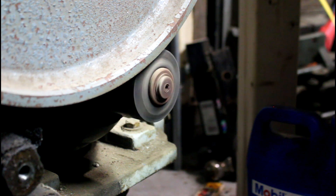So you can hear that. It is currently turning counterclockwise. I'll turn it back on the slow speed here and hopefully we'll get the correct direction. And it's not — it's spinning clockwise. But that is slow speed, so hey, there we go. Easy fix — I can switch two wires around to fix the rotation of the motor. Figure out which side is the slow side, and figure out which way this guy is supposed to turn. Hey, there we go — it's three-phase. Yay. Score one for Brett here. Good job — giving himself a pat on the back.